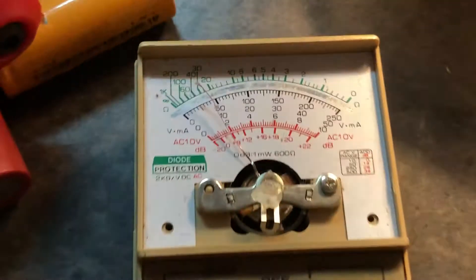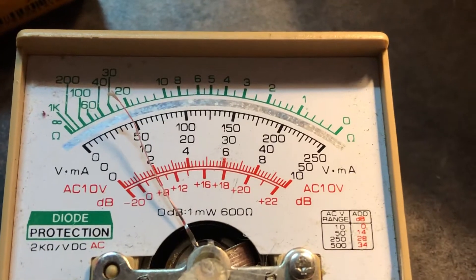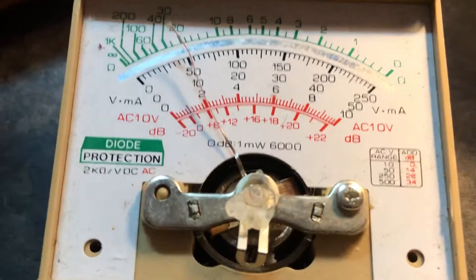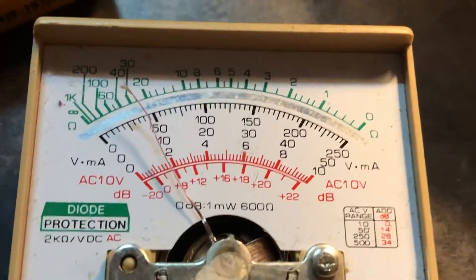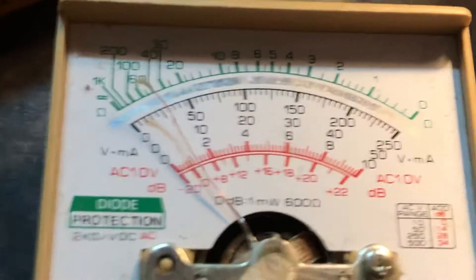So I need to take four diodes and put them in a square so I can get DC volts out of this to put in my inverter. I got a big lead-acid battery and a 500-watt inverter — it's just for testing, I'm not trying to go off the grid. Oh, there it goes — it's going to take off right now — oh, 15! The highest I've got it today was 30, but that was for a really big gust of wind. I bet it was spinning at like 12,000 RPM. So it's not very consistent, so I need to get it into a rectifier so I can charge a battery.